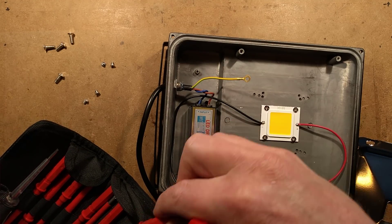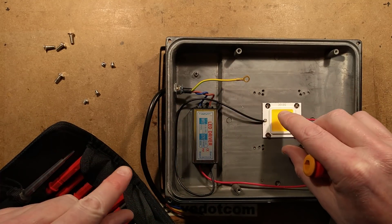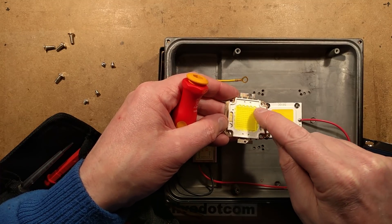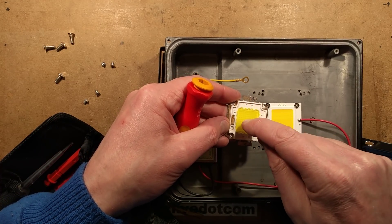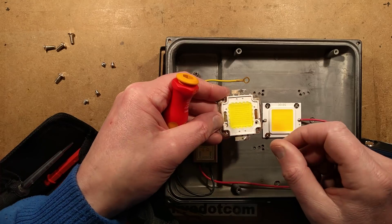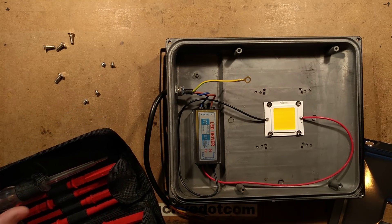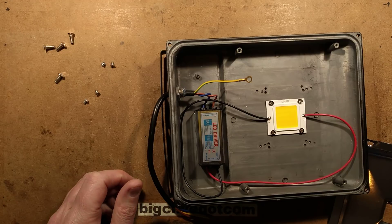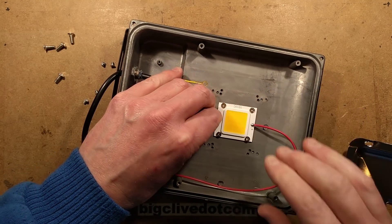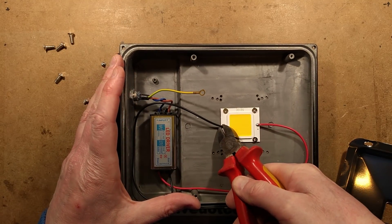One of the things I found with the other LEDs before was that as you turned the voltage up, the LEDs were not very evenly matched. I get the feeling that this style with the bond wires going across onto the bus bars — the bond wires effectively damaged the LEDs because they're trying to spot-weld tiny wires on and then onto a heavy bus bar at the end. Most of the LEDs on eBay were probably crappy ones being used as the skip. So let's see if I can just pull these wires back, grab the insulation, and nudge it back without cutting the wires to get a crocodile clip on.